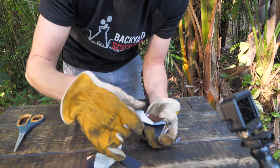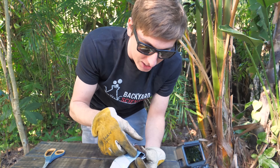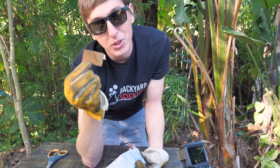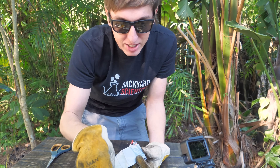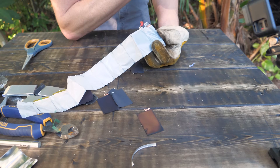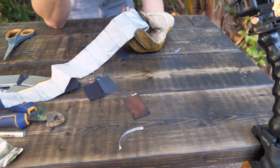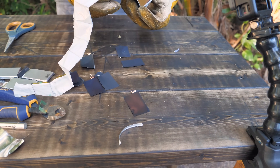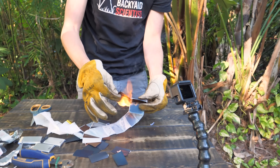Between them to let the electricity flow between the two plates. This is the negative electrode right here and it is actually a piece of copper with carbon on top of it. You can see it changing colors in the atmosphere from the oxygen — there might actually be some lithium metal in there even though there shouldn't be.